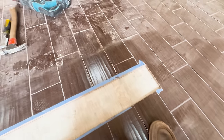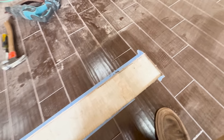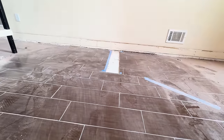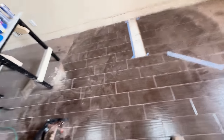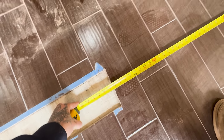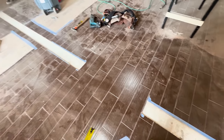We're looking pretty good. I cut this hopefully around 5 3/4. Nah, it's 6. Gives me plenty of room for my 5.5 inch plate. So we've got a door opening from there to there. My door opening is 40.5 for my RO, so the tile can stay. The timely doors will go in. Tile will fall all the way through and look like this place was built this way.